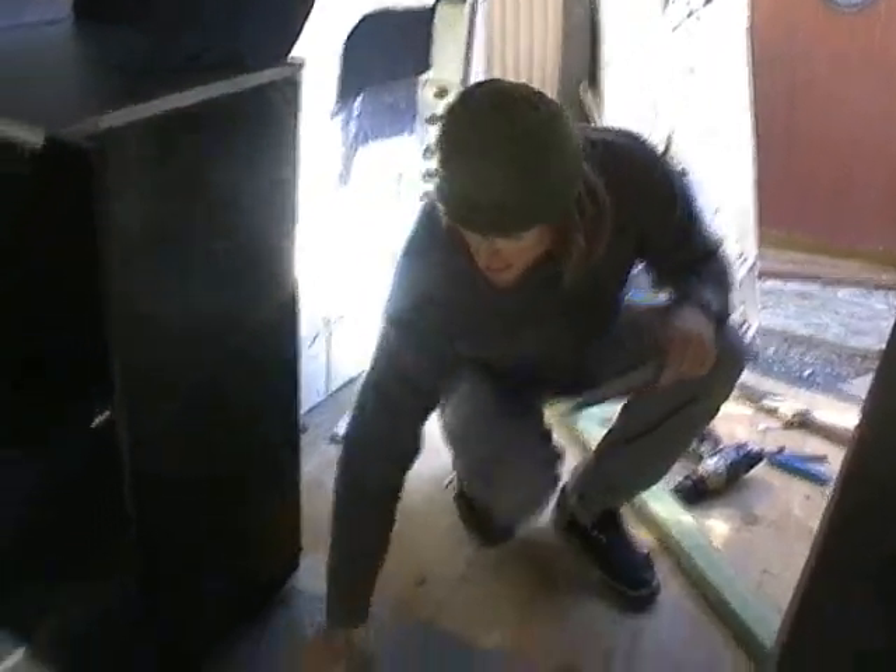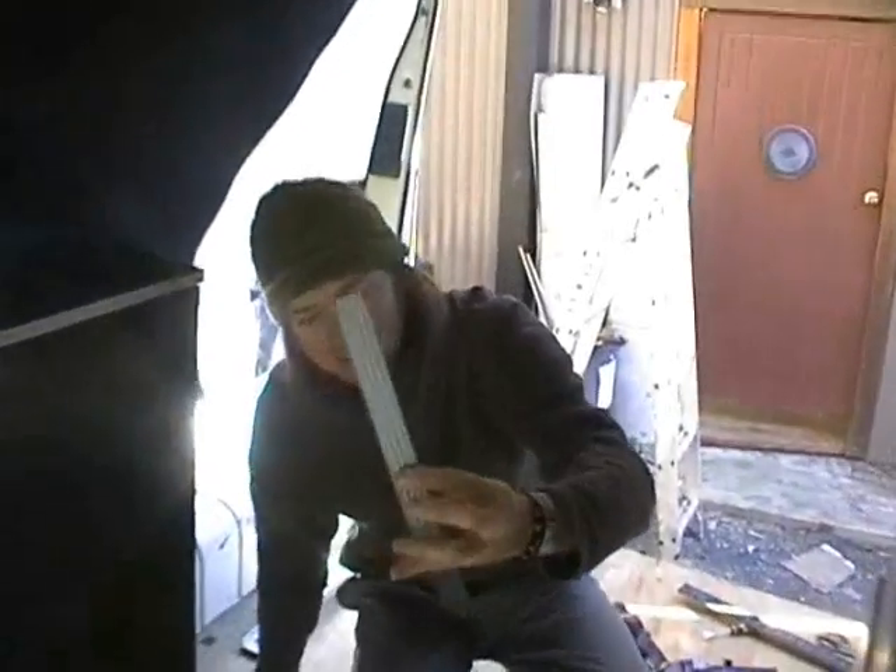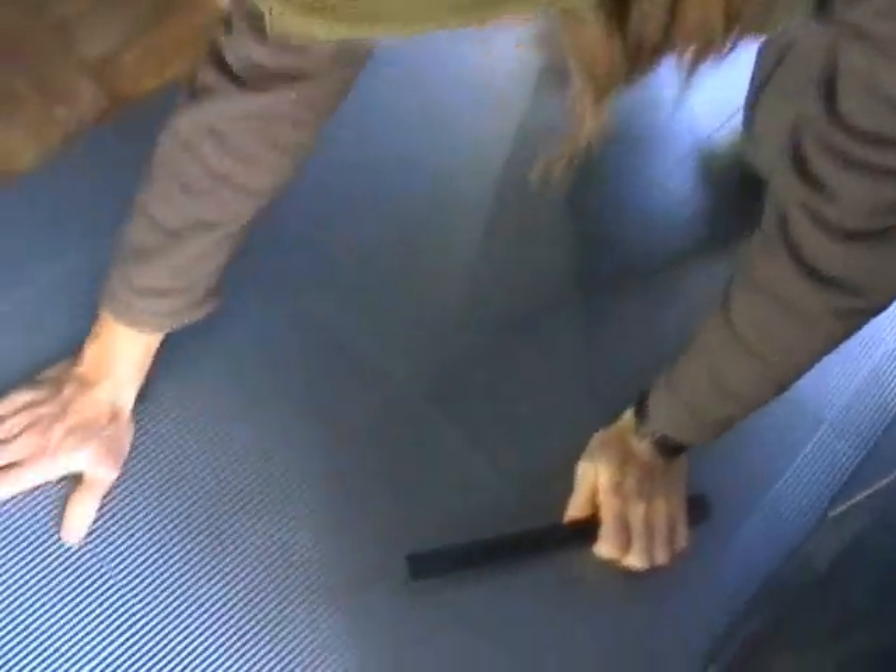Last night I finished putting in the super special rhino tile floor. This is the type of material — lots of tiles but they look like Star Trek. I just used standard contact adhesive, glued both sides, let it sit for 20 minutes, and then stuck them down. It's come up quite nicely.